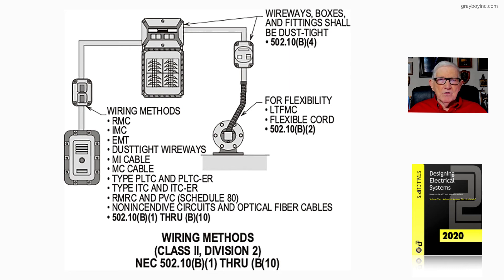If you're using purged and pressurized motors, we refer to NFPA 496 starting at section 4.11 to design the requirements needed for such an enclosure. For a Class 1 Division 1 motor, you have to sweep the enclosure out with 10 volumes of air, purge it thoroughly, then pressurize it — and then the motor can start, accelerate, and drive the driven load. That is exactly what figure 21-25 is illustrating: the requirements for motors and generators in accordance with NEC 501.125A and B.